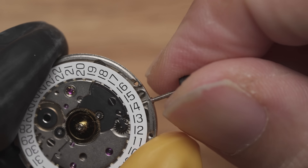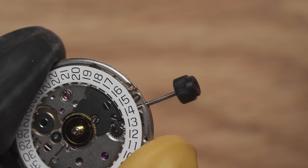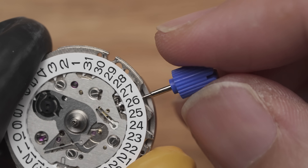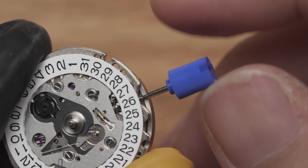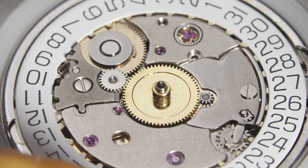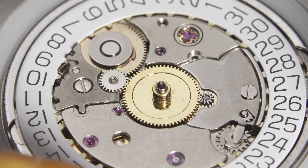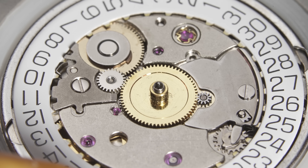You can then try to wind it up. The winding gear feels and sounds tighter on the SW-200, while the Japanese counterpart feels coarse to turn. This is due to the SW-200 having a tighter tolerance with its parts, including the gears — there is less gap between the gears, resulting in a smoother winding sound.